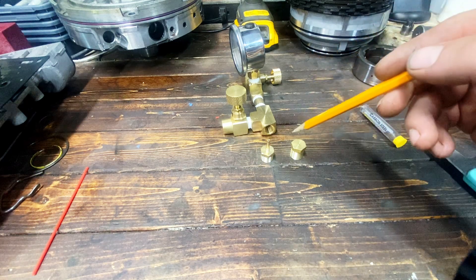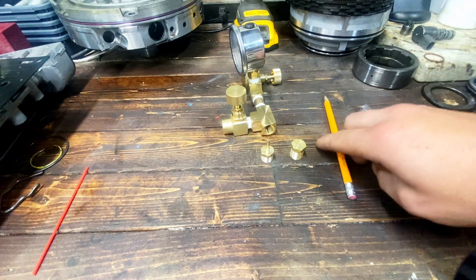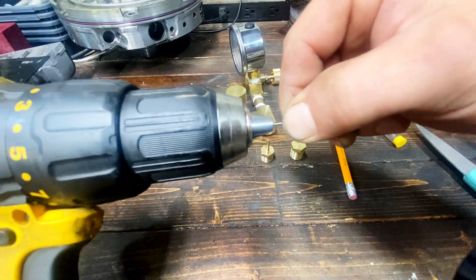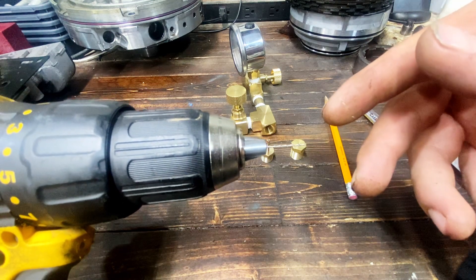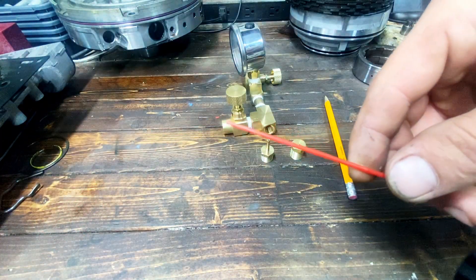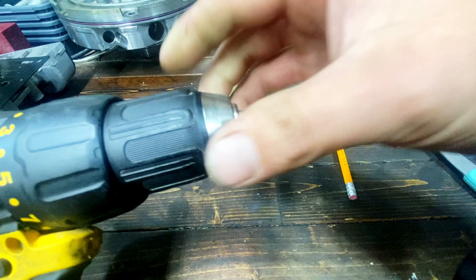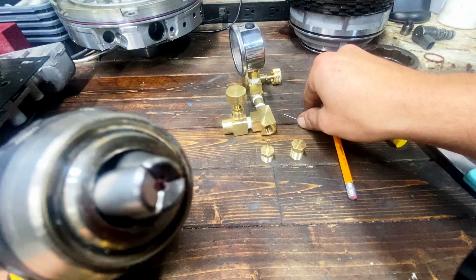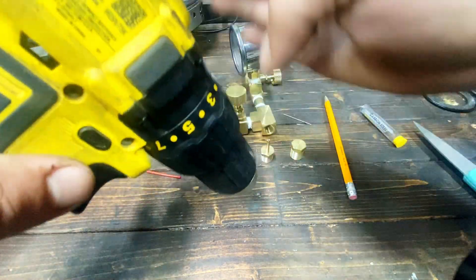What we're going to do is drill that number 65 hole just roughly center in the M-plug. It doesn't have to be perfect as long as the hole is good — you don't want to wobble that hole out. Now, I'm going to show you the trick. I already got this chucked up so you can see, and it's nice and tight. If you're anything like me, you have a myriad of these plastic straws from your cleaners. You're going to take one and cut it down to size. You can see that just pulled out, and hopefully you can kind of see in there — I got one of those straws in the chuck.